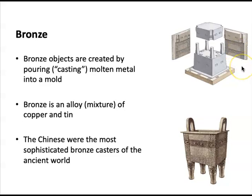With the lost wax method, you'd also use clay as your form, but in the lost wax method, you break apart and discard the broken clay. You don't have these pieces. That's what's important. You can separate and preserve these clay pieces to make more vessels. And this is the key to why Chinese metal workers used piece mold casting. They wanted to make additional replicas of the same bronze object. Not one, but 10 or 20 or 30 and so on.